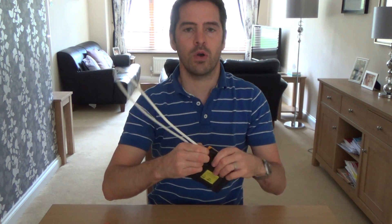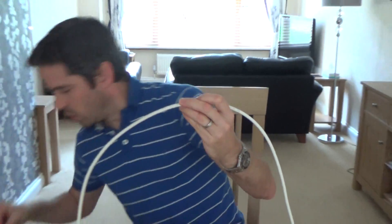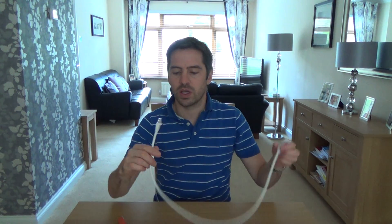So basically when you're doing it, just make sure you get the proper CAT6 plugs that do solid core and stranded core, and get yourself a strain relief boot, and obviously know the cable you're working on. This cable here is CAT6 - I know it's CAT6 because of the inside of it, but cable will be marked up as CAT6. And CAT5e cable will be marked up as CAT5e. So this marking tells you what it is, but you'll know yourself by looking at the inside - if you've got the cross member running right the way through it, you know it's going to be CAT6. That's how you crimp CAT6 plugs onto a CAT6 cable. Thanks very much - if you need these products please check out my eBay shop. Please subscribe, and if you found it useful give it a thumbs up. Thanks very much for your time.